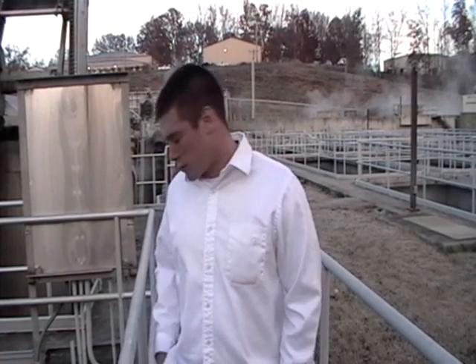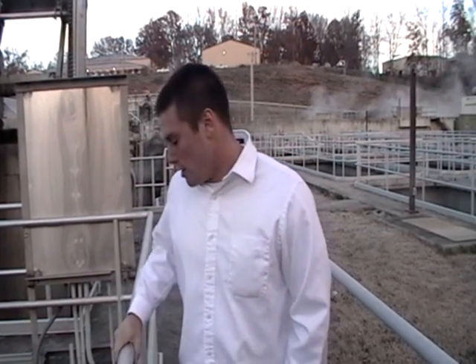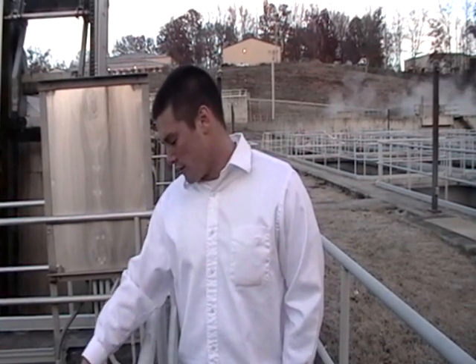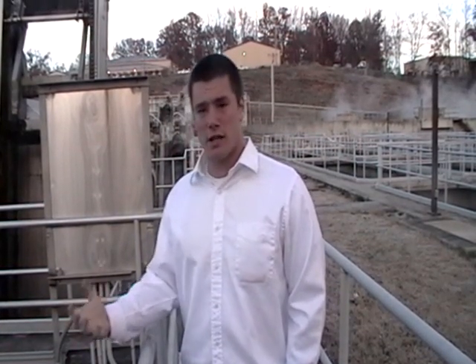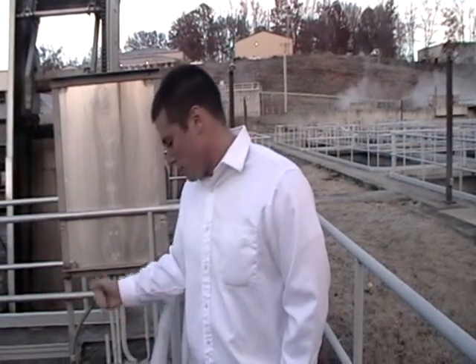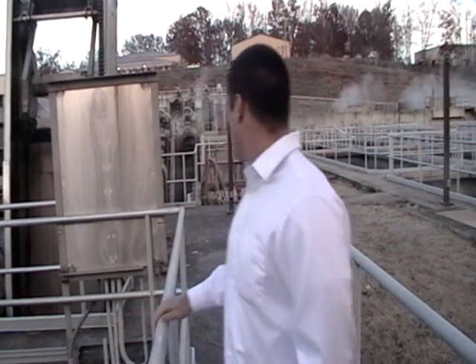The first step of this process involves the grates at the bottom of this tank. The water comes through from the streams of the sewage and it's divided out. The large deposits that you can actually grab with your hand are taken out by the first grate, and the smaller grate down there will take out small trash, and it will be pumped through those turbines over there up to the top of the plant.